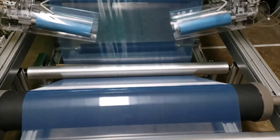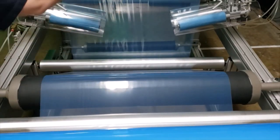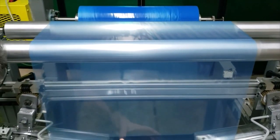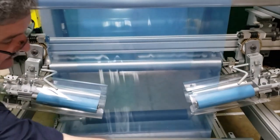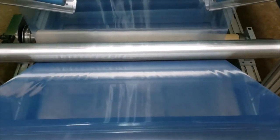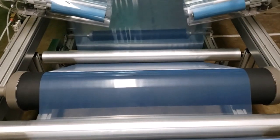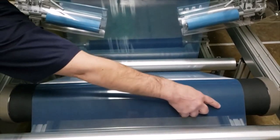What you'll see here with this roll is, at this point you're going to see some wrinkles going across the top because of the skewed roller, and you're going to see some wrinkles in this section. You'll also see some wrinkles on the input side of the roll, but on the output side of the roll the web is completely flat. All these wrinkles coming into the roll are being completely removed — flat on the output side. You'll see a lot of wrinkles coming in and no wrinkles going out.